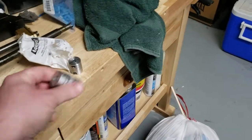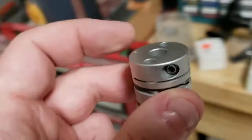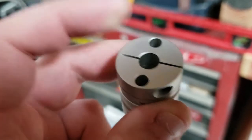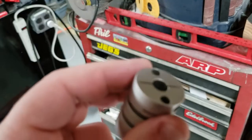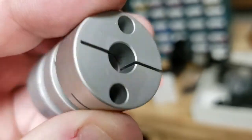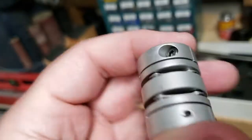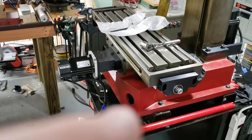I had a bit of an issue with Fleabay. I ordered these — they're beautiful, great looking — but the problem is the ball screw shaft diameter is one or two thousandths undersized. These are 8mm and not five-sixteenths; the nominal dimension is supposed to be 312 on the ball screws but they're actually 310, so that five-thousandths difference means they will not clamp. I spent a lot of money on these and now I can't use them. Be warned — get yourself a set of Lovejoys. A little bit of searching on Amazon and we were good to go.